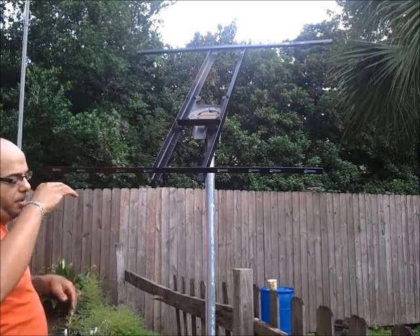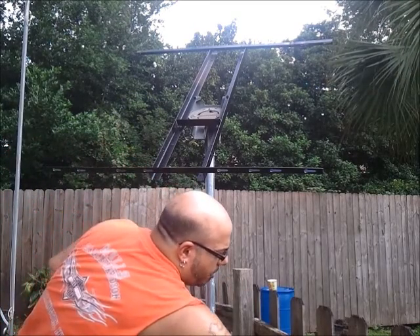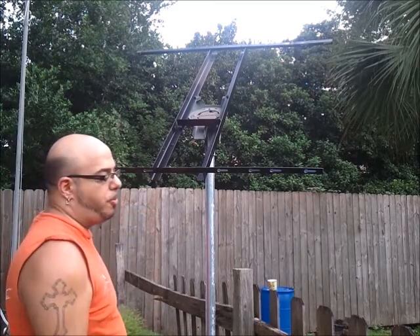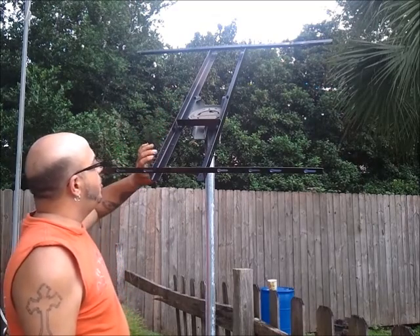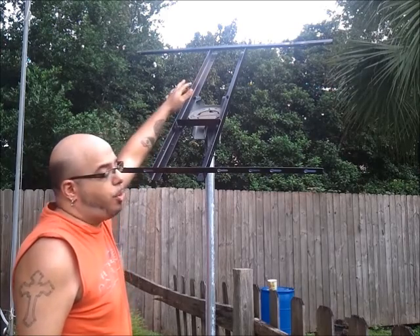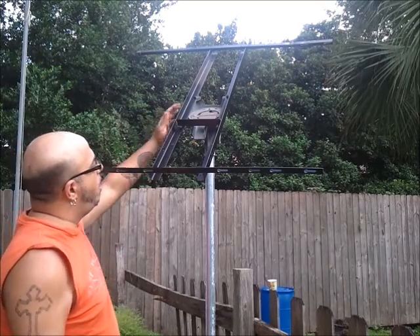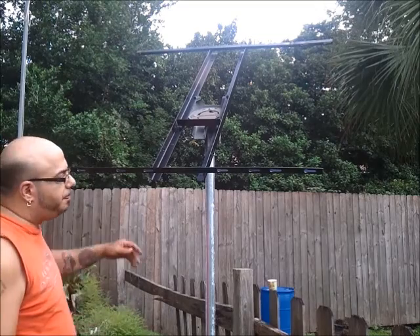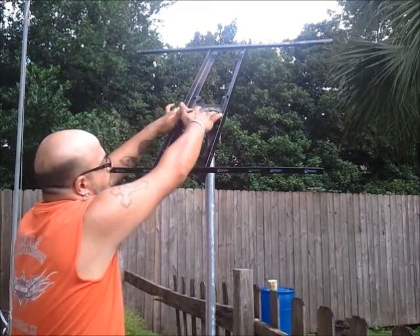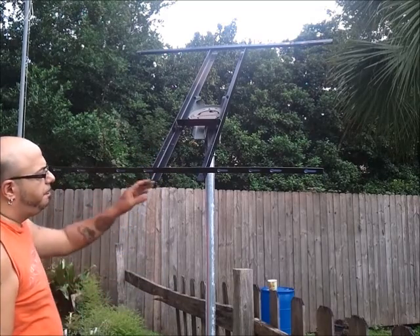Basically what I did was measure the entire height of the solar panels — it's 38 and a quarter inches total height. I'll put the measurements in the description below. I cut my two uprights the same length, giving it a half inch longer than the panel itself. I got lucky because there were two holes already in the bed frame. I ran the exact bolt that came on the dish, ran it right through, centered both of them, and realized it was just about centered where I want it. The two mounting bolts go in about an inch and a half narrower than the poles, and I wanted to keep these as upright as possible to hold the weight and transition the load back to the pole.